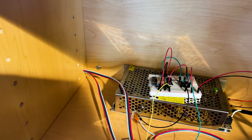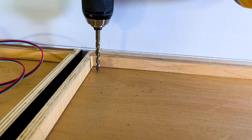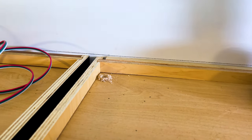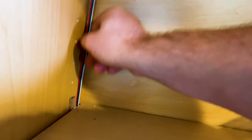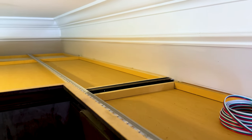To get a wire up for the upper cabinet lighting, I'm going to run a wire from here up through the top — it should poke out right up here. I've got my drill ready to go and we'll drill a hole right through here. That should give us just enough space to get our wire through. We want to make sure to pull enough wire through so that we have room to connect everything. Next we're going to run a wire down along the length of these cabinets so we can get to the end of the track and solder that on.